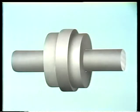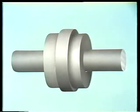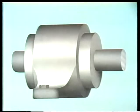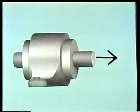To support axial load, you need the other type of sliding surface bearing: a thrust bearing. A thrust bearing is used with a thrust collar — another term for a thrust collar is a thrust runner. Usually you'll find two bearings, one placed on each side of the collar, held in place by a housing. This type can only support axial load; it keeps the shaft from sliding through the bearing.